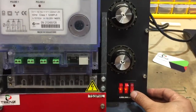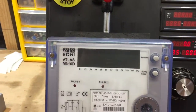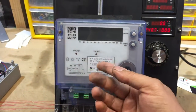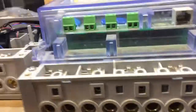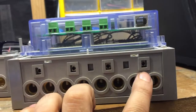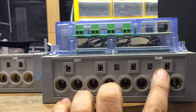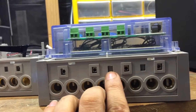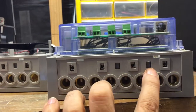If I go to auxiliary measurement and turn the mains off, you can see the machine switches off completely because this particular meter doesn't have an auxiliary input. So basically this is phase A, phase B, phase C, and neutral. But when you have auxiliary enabled, these two become the auxiliary input and that becomes the neutral. So you've got phase A, phase B, phase C, and neutral, while these two are auxiliary.